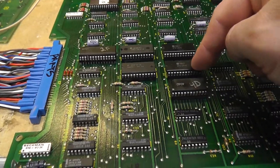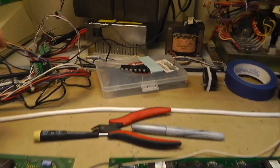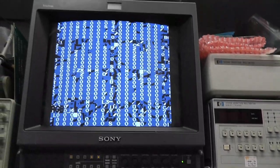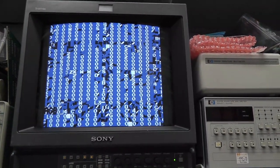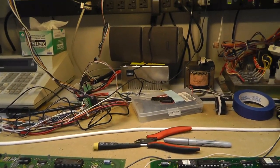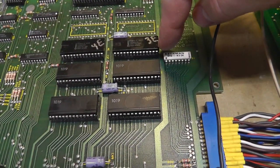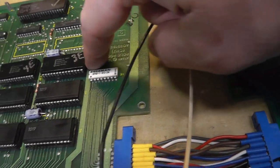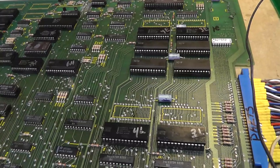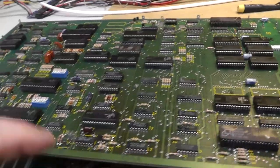2F is in the sync counter chain I think, so I doubt it has anything to do with reading our RAM over here at 4E and 4F that was reporting bad. Let's power it on — and that's not good, we've got problems. I see 3E there — that's 3E and 4E. I thought I found a problem. This might be a CPU board issue — not booting up after cleaning the board.